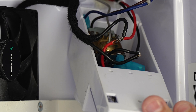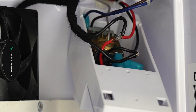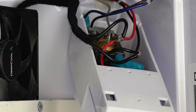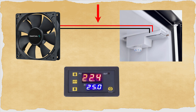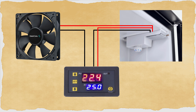I'll run you through my plan for the wiring. I've just removed the electrical tape from the joins so you can hopefully see them a little bit better. Essentially this red and black wire here — they're my constant positive and negative for the built-in fridge light, so those two connections have power constantly so long as the fridge has power. That's where I've tapped the current fan assembly into the positive and negative. To install my temperature controller module, I'll be leaving this positive installed but adding an extra positive into that connection, which will be run back down to the controller module. I'll then be disconnecting this earth power supply from this join and routing it instead down to the back of my controller module. I'll then run an extra earth back down to the same temperature controller module, and get a little bit of extra wire to bridge the connections between these two. And then theoretically we should be good to go.